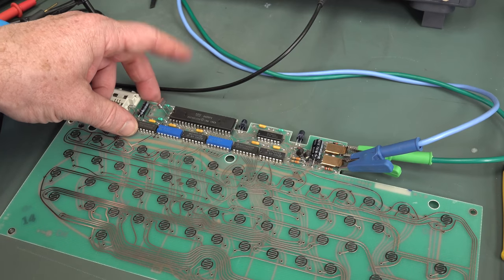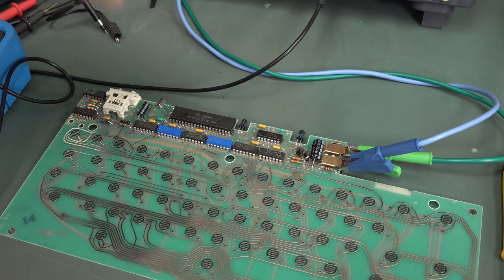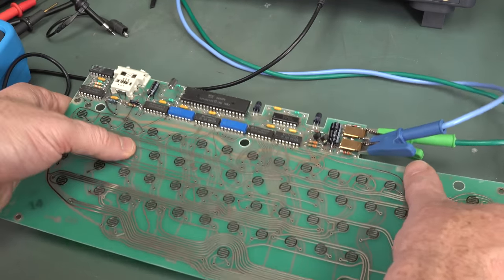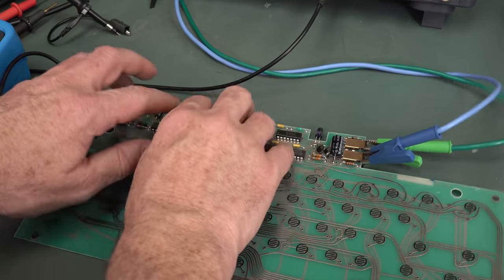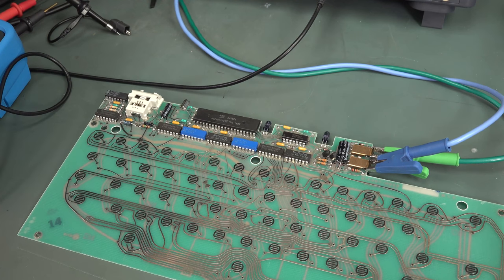There was nothing wrong with that crystal, because I turned it off and on and it's gone back — it's failed again. So what I'm going to do is just look at my current display and give that a bendy bend. My current just stays on zero. We've got an intermittent startup. I hate these things — intermittent problems like this make troubleshooting a real pain.